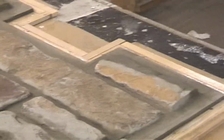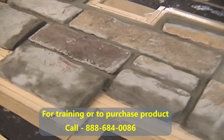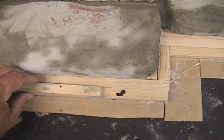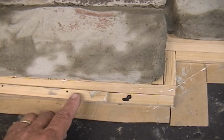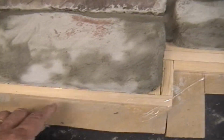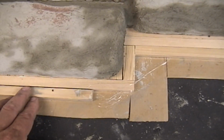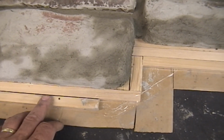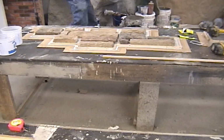Whereas I, over here, have already grouted this one, repaired the bricks, and now we're getting ready to put on the mold, or the form, which this will be a form right here, so that the rubber can be in here and go underneath that rock. So we've got to put all those on. That'll form the rubber. Then we'll take this off, cut this cardboard, put the board back on. Now the cardboard width is about an 1/8. Our hard mold will be actually down to this. It'll be down an 1/8 inch anyway. So this is our 5th day on this project, and we're having some fun.